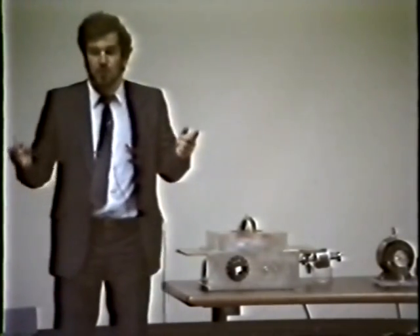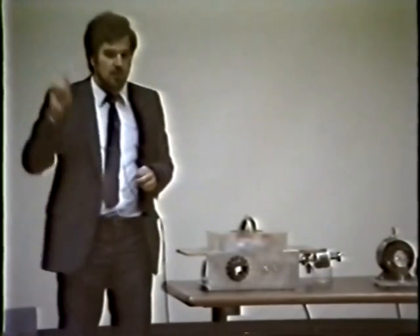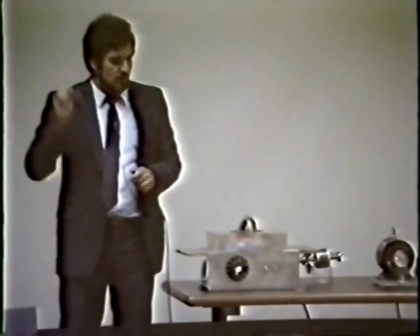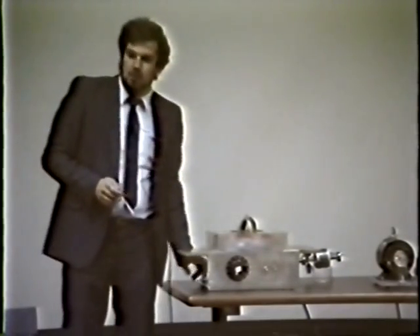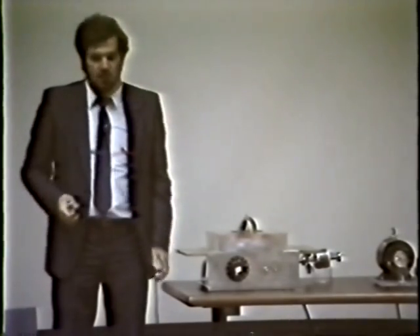What is underneath in the box is actually a little scheme, because it's very difficult to get two-phase and three-phase systems in a building like this. They're usually wired for industrial buildings with heavy power, so you have only a single-phase outlet. We use capacitors to phase-shift from a single-phase to create a two-phase system, so we kind of faked it and got a two-phase system driving these coils.